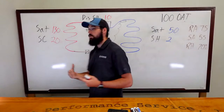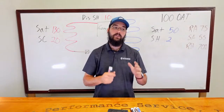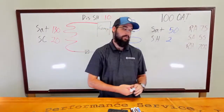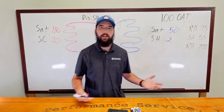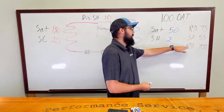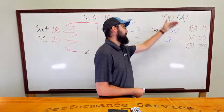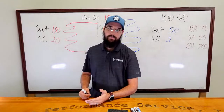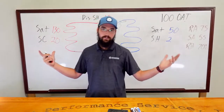So ultimately the system is cooling and it's not tripping. It's not having any other symptoms. It's cooling. The complaint was, it's just really uncomfortable. It's humid. It's sticky. I've got a thing on my desk that tells me what the humidity and temperature is, and it doesn't say what I want it to. Whatever version of that complaint comes through, the humidity is what they're complaining about. And somebody having overcharged this forced our evaporator saturation so high that we could no longer process that humidity correctly. So you take a couple of pounds out of the system, and you start to see everything normalize.